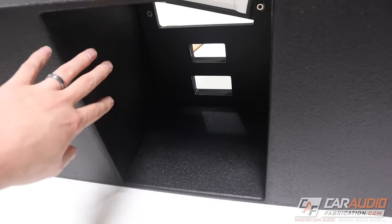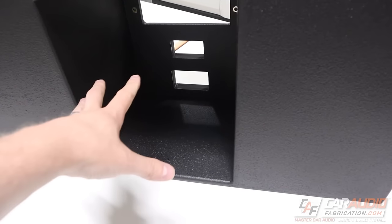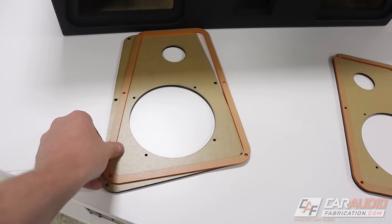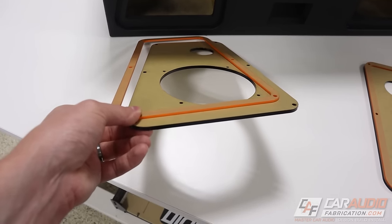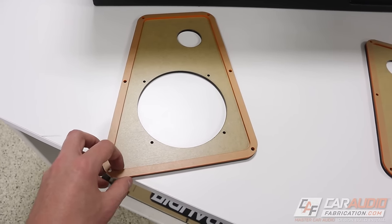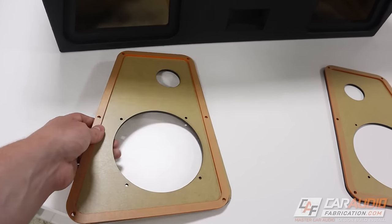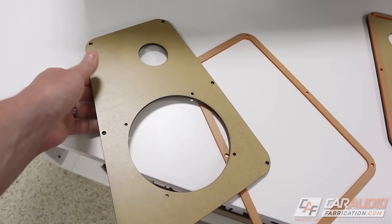The enclosure is now completely coated — I even coated the backside. I'm doing my setup a little differently than you might for a regular boom box because I want access to all the wiring to switch up my configuration as needed. I have these plates made on the laser: a quarter-inch black acrylic plate on the bottom and an eighth-inch acrylic plate on top for a trim accent. What's neat is I designed these so that if I want to swap out the speakers and test different ones in the future, I can easily do so just by switching this plate.